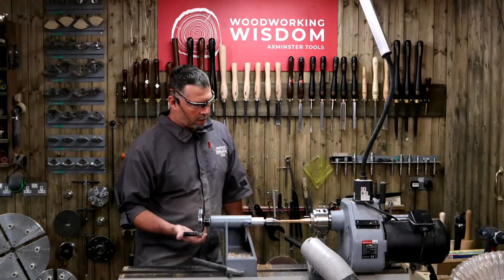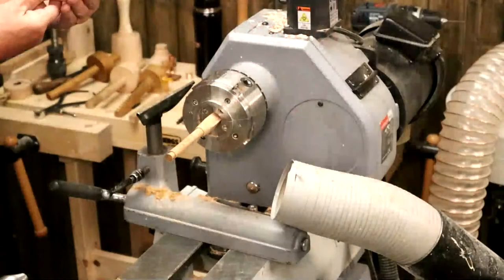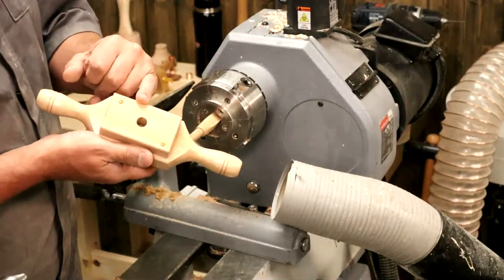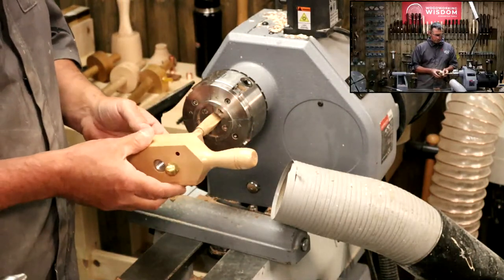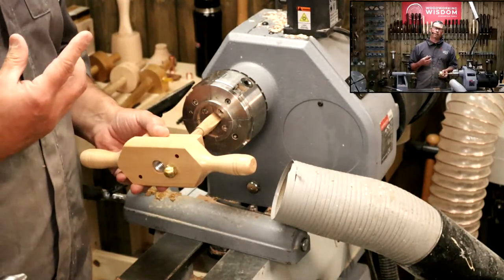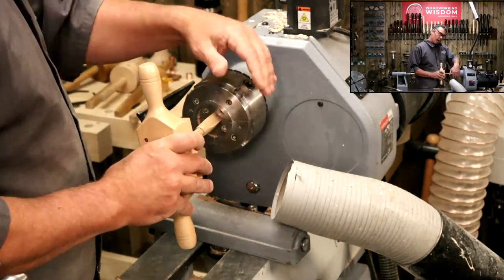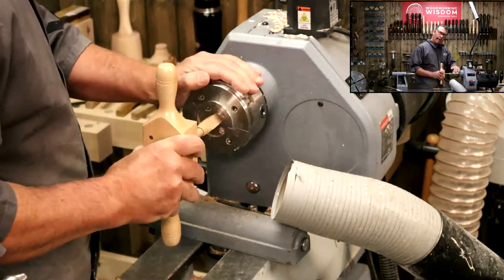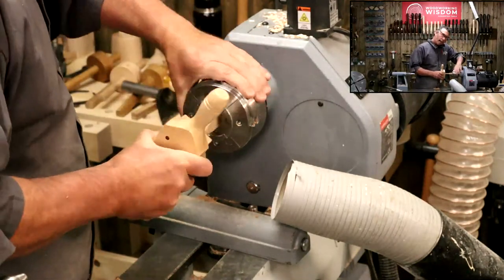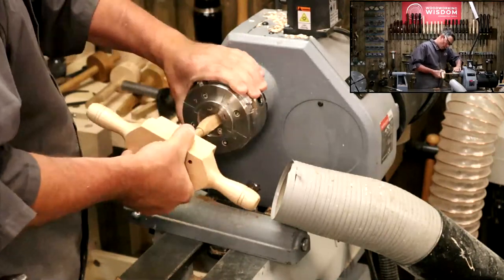So just bring your tailstock out the way. Your box for threading, you have the lead section, so the blank section goes over. When you start off, you have to have a little bit of pressure, so I'm going to push forward and rotate. Let me get my tool rest out of the way. Push forward and rotate. Once you've got it biting, then you're away. Then you can just start winding.